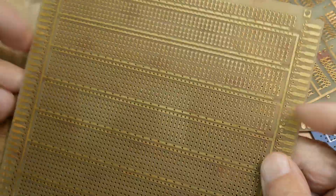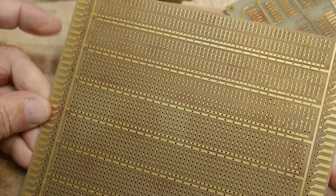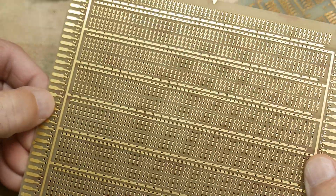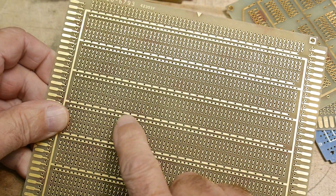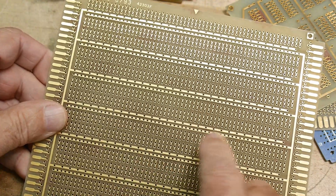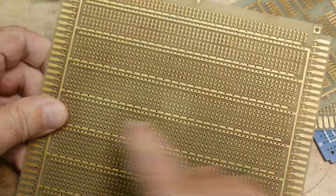But then they had these boards, and these were my favorite proto boards when I was working at Hewlett Packard. The part number was A5020-6793. These proto boards had duplicate edge connectors on both sides and at least had little traces going out for you to solder. What I really liked was that it was on 0.3 centers and had two traces running underneath. The ones that skipped a via were the ground lines, and the ones that had every via were power - or however you wanted to wire it.